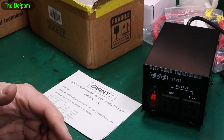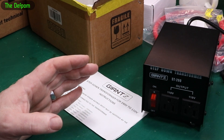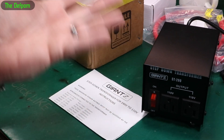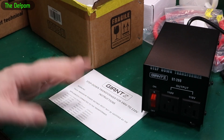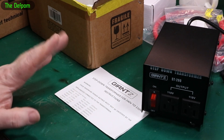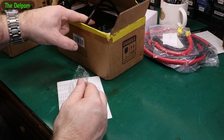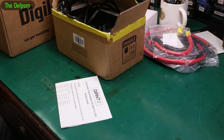So watch out for that, because some of the claims you see on products are ridiculous. The claims were from a local auction site called Trade Me — not eBay — and those claims were also made by the original seller on AliExpress, where the listing had the same ratings. So the local person who imported and resold them may or may not have known any better — they just had the wrong ratings because that's what was claimed when he bought them. Also not unsurprisingly, that fuse on the back of this has no rating on it — nothing saying what that fuse should be. To replace the fuses it's a one-amp fuse — that's probably okay for 200 watts at 240 volts.